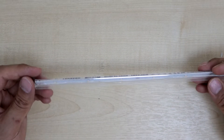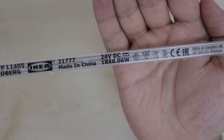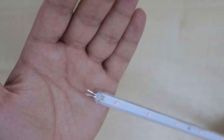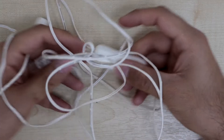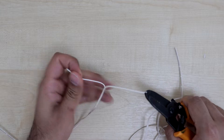The next upgrade is a 24 volt LED light from IKEA and it's perfect for this upgrade. It also comes with two pins that were attached to this connector but we will not be using that. I then cut the wire to length and stripped the ends to solder them later on to the USB mount.